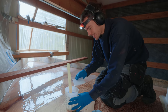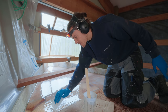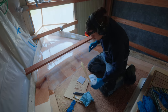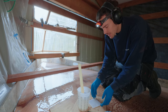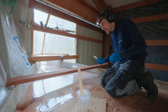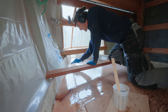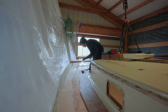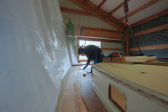It's always slightly terrifying to be working with such big quantities of epoxy, isn't it? Yes. So it is a true blessing to have the slow hardener for this task. And it's not very hot today. Exactly, yeah. But still, I can't help it. My heart rate always rises. I try to hurry, you know what I mean? Totally. We were working as quickly as possible. It would be disastrous if the epoxy started to cure before we were ready to press down the layer of plywood.